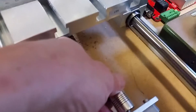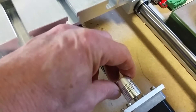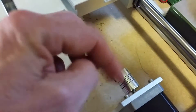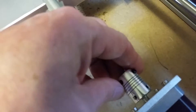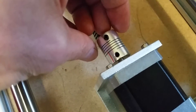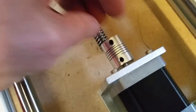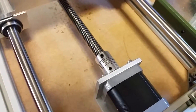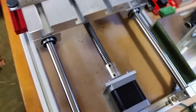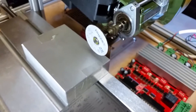This is just a NEMA stepper motor — one of these little Chinese ones — with a flexible coupler. It's really clever: it's just aluminium tube sliced in concentric rings so that it makes a kind of spiral, making the thing flexible. Any misalignment with the ball screw gets taken up by that, so it doesn't stress the motor or cause any binding at all.